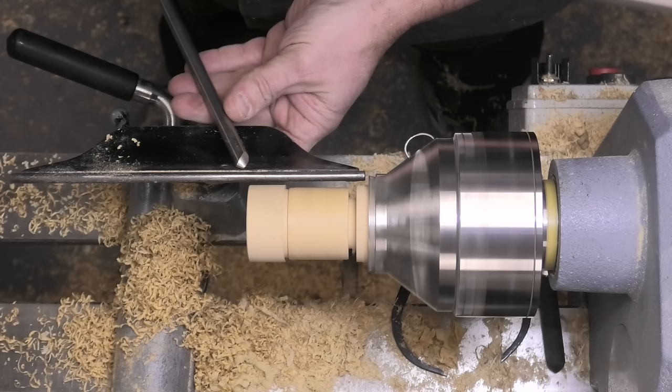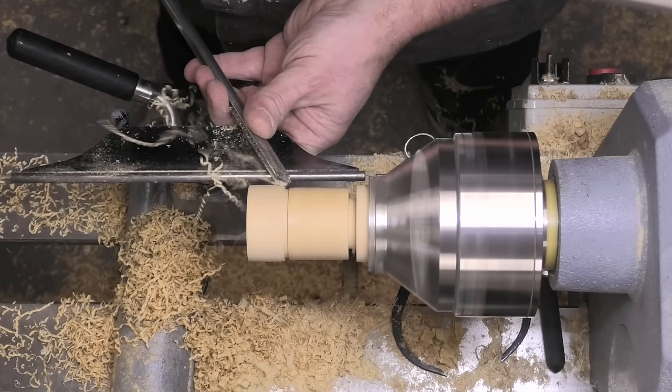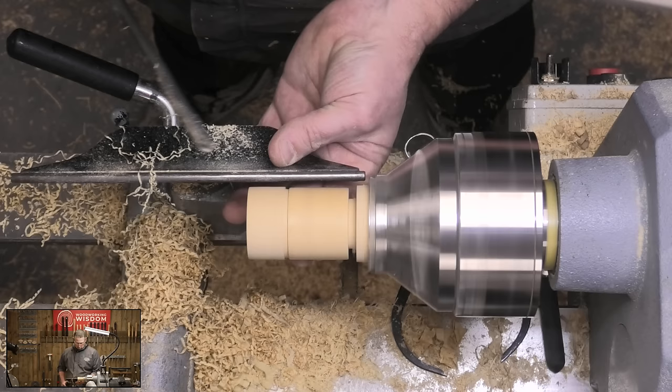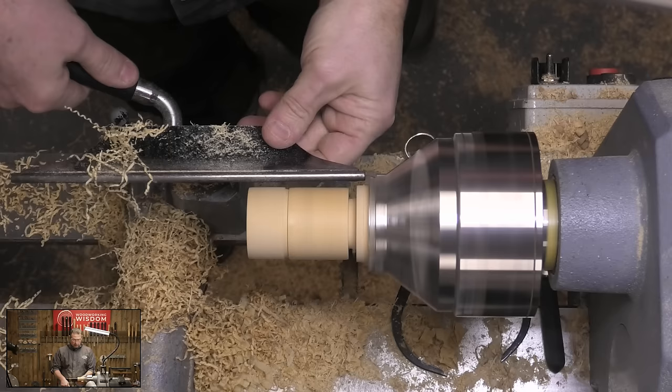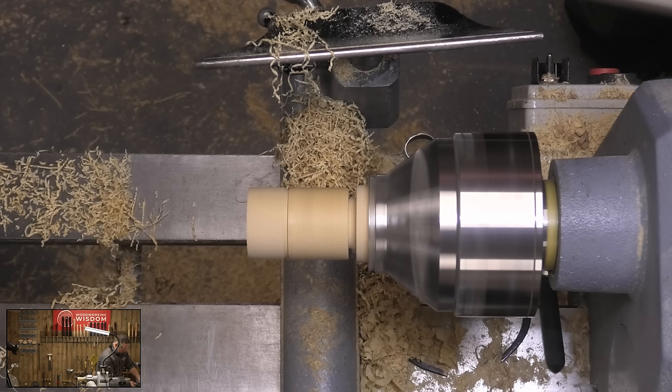Double check on our lid — once we get back close to that point, yeah that's looking pretty good. Once I've done that I can then take the diameter away, clean everything out. I'm going to go with a bowl gouge now — just going to skim that surface. That's that bit done. Let's go to the outside edge now. We'll clean this back to meet up with this surface and then we should pretty much be there, bar the drilling. I'm going to skim with handle down low. Pretty much all we're making here is a threaded box — that's all it is. Let's have a sand, and once the sanding is done, we'll drill.